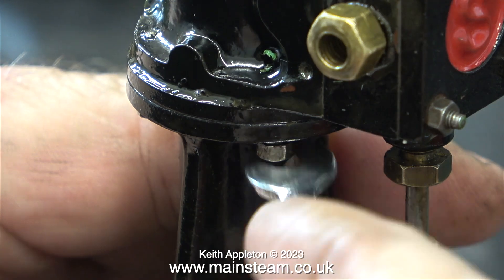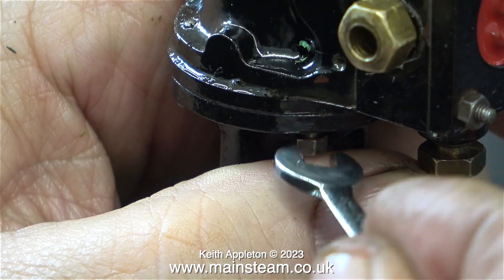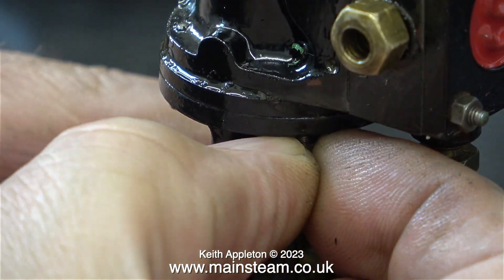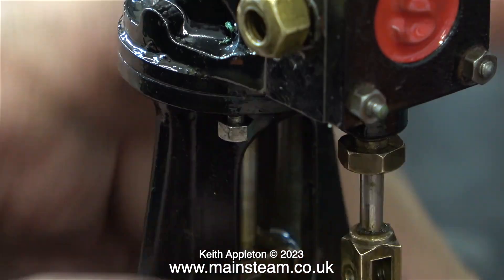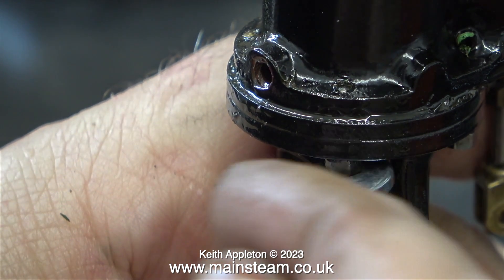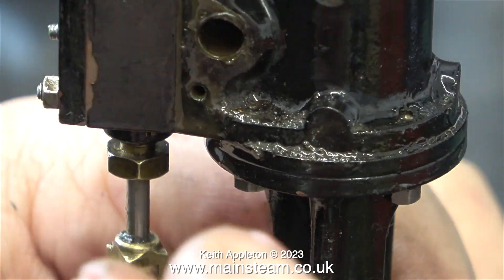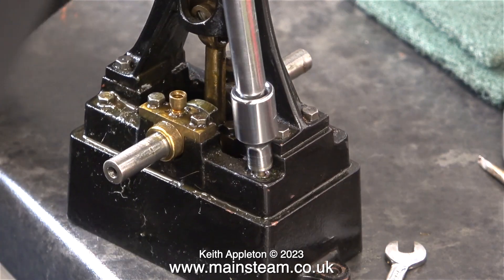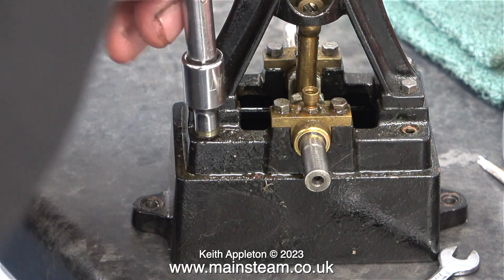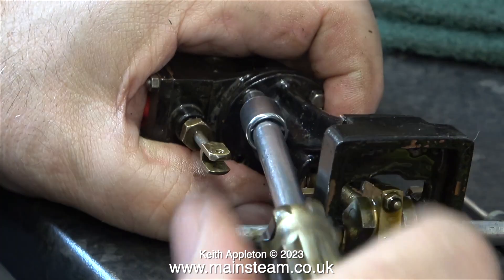This part is a pain and I can't really get a socket onto the bolt. It's time for the vigorous use of a small spanner, and the bad news was the bolts didn't become loose as they came out of the cylinder — it looked like it was going to be spannering all the way. Then I had an idea: why not remove the box bed? This will allow me to use the same socket and socket driver to remove the securing bolts from underneath the cylinder.